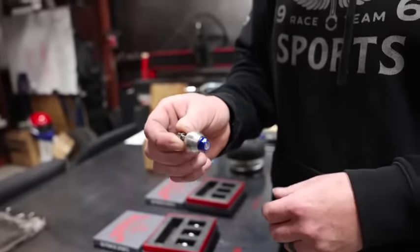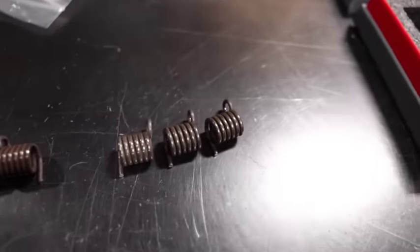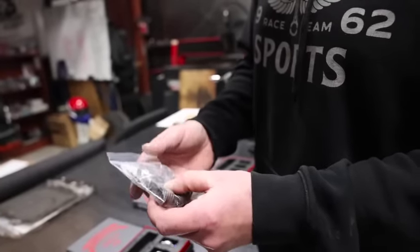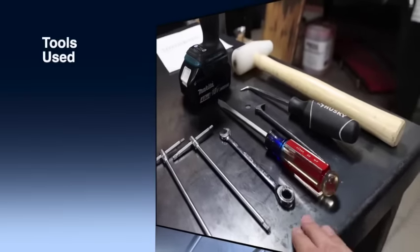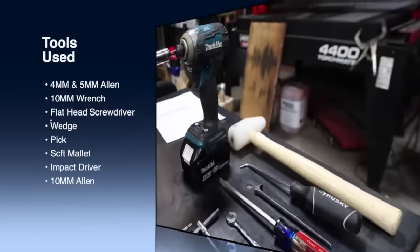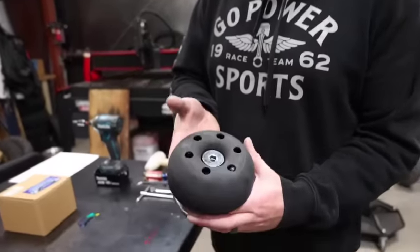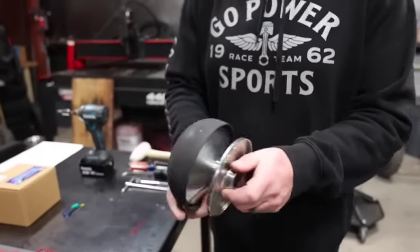And then tuner kit three adds an aluminum roller. This is the lightest roller you can get — it'll give you the highest stall possible. The springs come with three lefts and three rights, and these add quite a bit of RPM. You can also run these on the stock setup. Here is the stock Juggernaut — a beautiful piece — and we're about to make it even better.